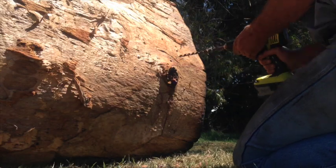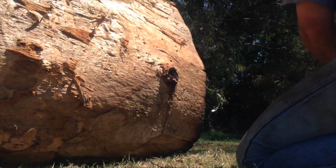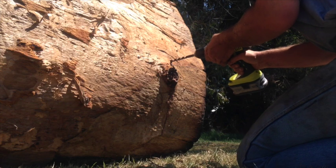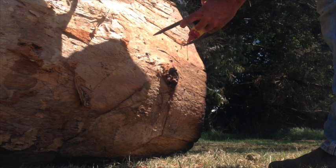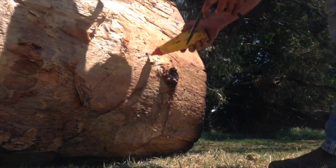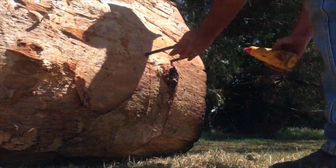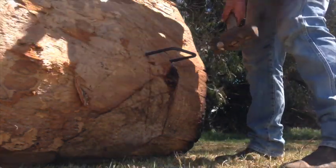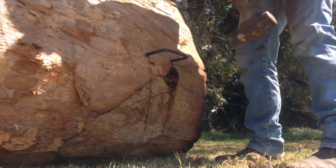Because it's a half-inch bit of rod, I need to drill the holes with a 7/16th drill bit. Before you drive your anchor in, you want to oil it up fairly well. And then just hammer it in, leaving enough room so you can easily attach the chain to the anchor.